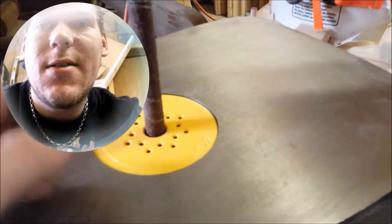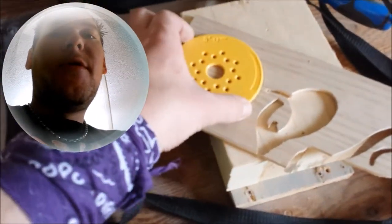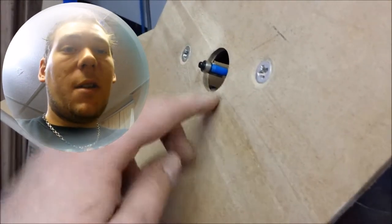So what I need to do is make one of these out of this. It's quarter-inch plywood with an oak veneer, so it has a smooth surface on top. I have a piece of scrap here that I have traced this on. I'm going to cut this out on the scroll saw, close to the circle. Then I'll go over to my router — I have a patterning bit on it which has a bearing. So our template, which is the existing throat plate, will sit on top of the piece I cut out of wood, right along this bearing, and it will cut our template to the exact size of the existing one, except it will be thicker.